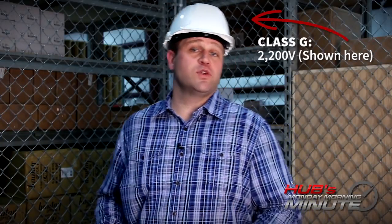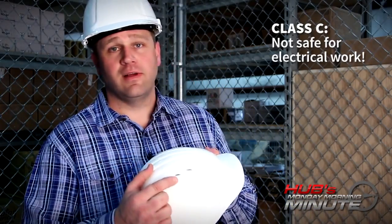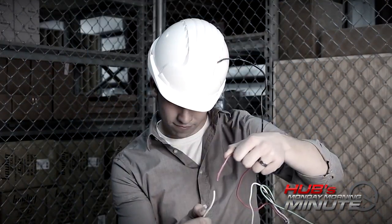So you've got your Class E electrical hard hat. The next level down from that is Class G, or your general hard hat, rated up to 2,200 volts. After that you've got Class C. Class C is vented, which I highly recommend — it does not have any conductive protection though. However, in Florida at the end of October when you're sweating, these are a much better choice.